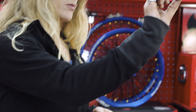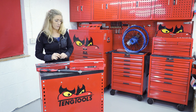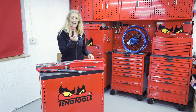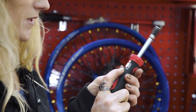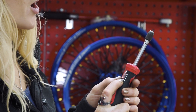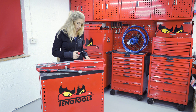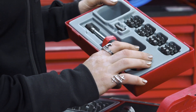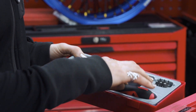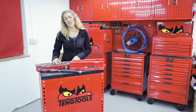So if you needed to torque a Torx, no problem. The final thing worth mentioning is that you can also get a screwdriver torque wrench. This is a tiny one, only going as high as 5 Newton meters, but if you're working on some really delicate engine parts it's going to be quite important. That set comes with hex, flat head, Torx and other screwdriver-type bits for all different requirements.